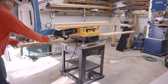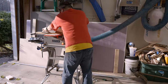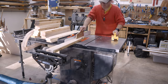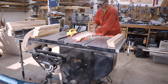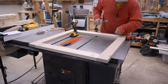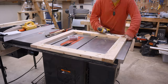I started by milling down the 2x4s to a common dimension to clean up the faces, then cut each piece to their final length. I flattened one side with the jointer and the other side with the planer. Why go through this trouble? First, it's good practice. Secondarily, it makes assembly a lot easier when all of the lumber is the same size and square. I added some pocket holes to the stretchers and then moved on to assembly. I used parallel clamps to align the boards and ensure they don't move when I screw them together. I started using fine pitch screws but they were stripping out, so I switched to coarse threaded screws, which helped tremendously.